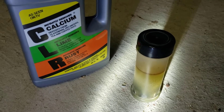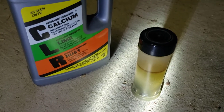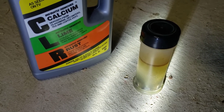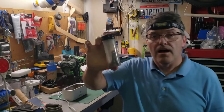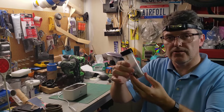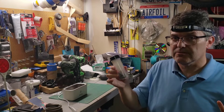I took all of the rusty screws and bolts and let them soak in CLR overnight. In the past I've used that to remove a lot of surface rust — it works pretty good. I've rinsed all the CLR out with water and shaken it up a lot to get rid of all the big stuff. Now we're going to put them in the ultrasonic cleaner for a quick clean to see if anything else comes out.